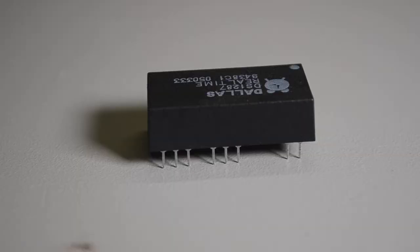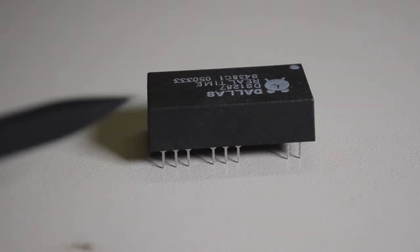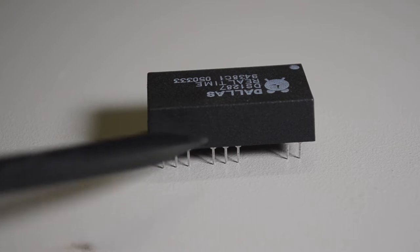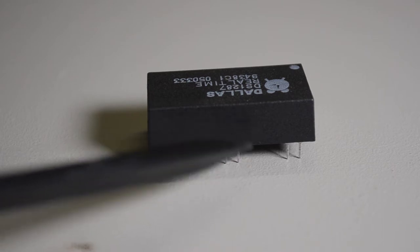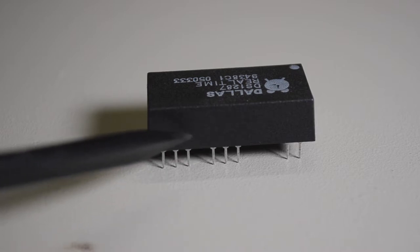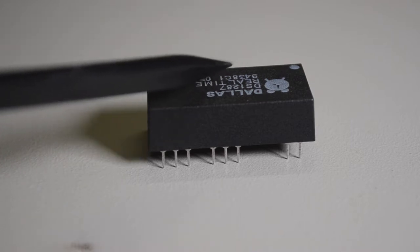Now these clock chips have got the clock chip itself and a battery in the top. What the modification involves is you cut away the plastic where the pin is missing here, and also here, and that will expose the terminals of the battery, and then you cut the one here and solder in a replacement battery holder up on top.